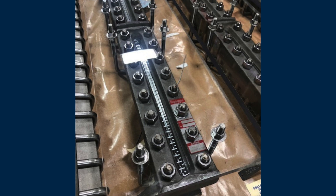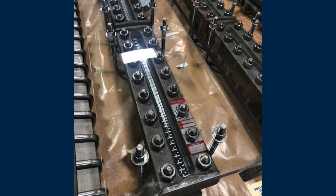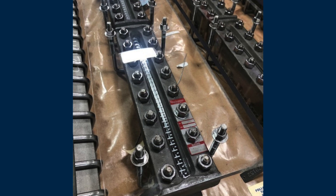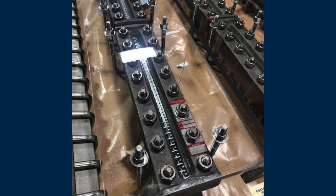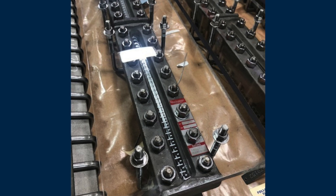Another reason instruments have issues is when they're not applied correctly mechanically. A magnetostrictive transmitter's electronics and sensor probes aren't designed to see high heat directly. If it's not designed appropriately — for example, if there's a blanket involved and the sensor probe is outside the blanket when there's heat, or if the electronics aren't remoted when they can be — the transmitter could be feeling the effects of the application. Heat is eventually going to deteriorate the instrument, weaken the signal the transmitter sees, and that could be the problem. So it could be an application issue: knowing the application of the mag and whether the transmitter was applied correctly to it.